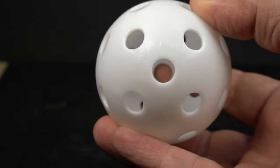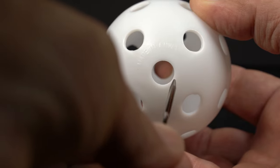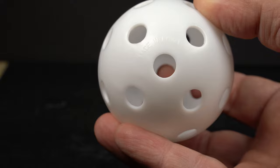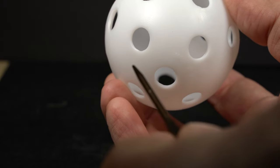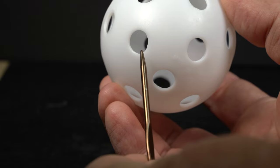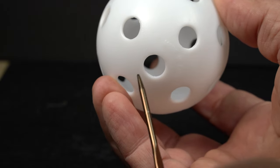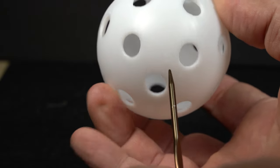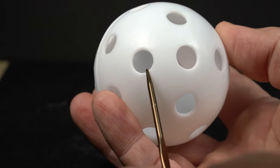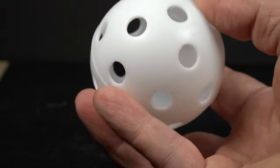The wiffle ball part. Now here's the fun of getting the mic assembly into our wiffle ball. We're going to cut a doorway into the wiffle ball, but first we need to make sure we have the orientation correct. It's a ball, right? Well, it is, but the hole arrangement really needs to be paid attention to. There is a top and a bottom hole. I use these to align everything. Identify those, and then notice that the rest aren't quite 100% symmetrical.